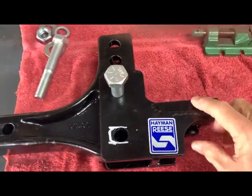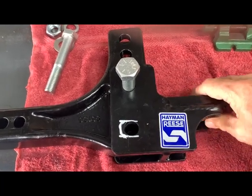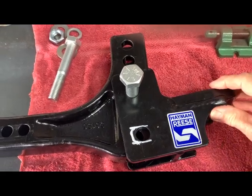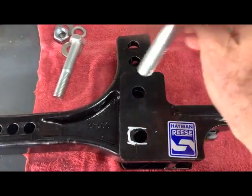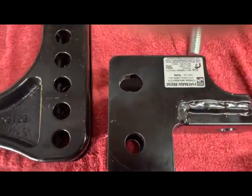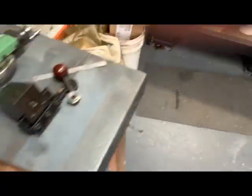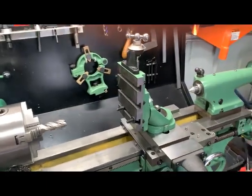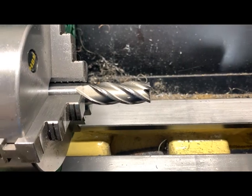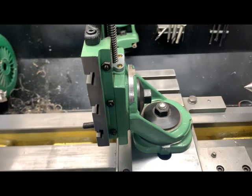This is the little job I'm doing. I want to be able to move this hitch here out a little bit — I don't want it straight up and down as normal. I want to elongate that hole and lift it out. The way I'm doing that is what I've done on the other side: elongate the hole, machine the hole out. The way I'm doing that is with an attachment on the Myford lathe — you can see we've got a milling tool in there. It's designed to do exactly this job and this is an interesting little attachment.